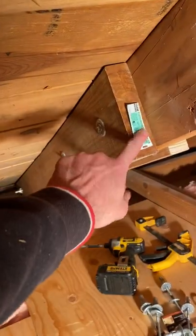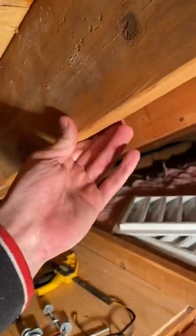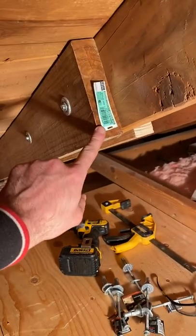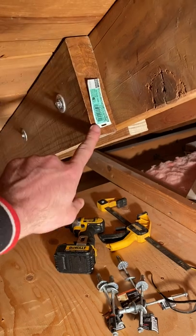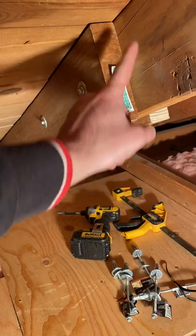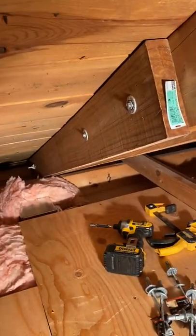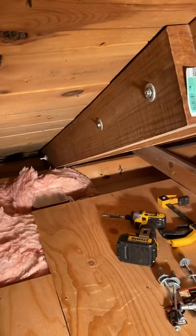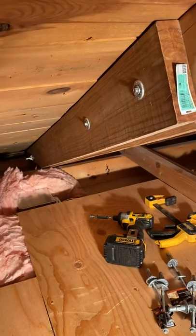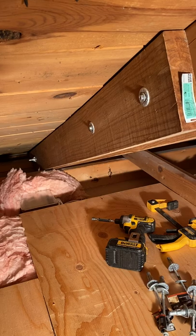From what I saw online, you want to get a piece of wood that matches your rafters. In my case these are two-by-sixes — this house was built in the 50s so these are actually two inches. I went and bought some pressure treated two-by-eights, ripped them down to six inches. The idea is to extend on either side of the crack about two feet. The crack was about three to four feet long, so I cut my board six feet, giving myself about 20 inches on either side.